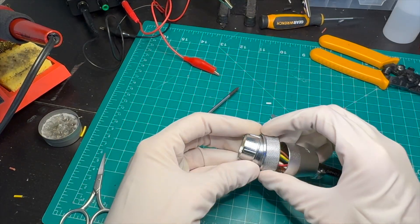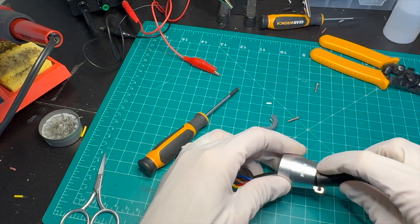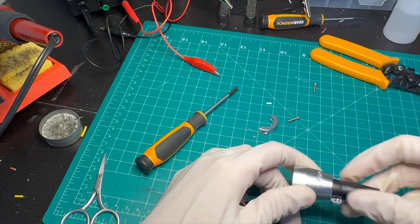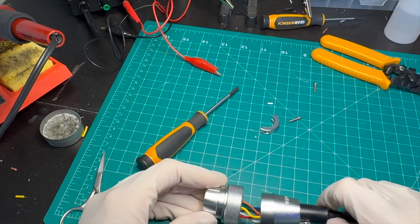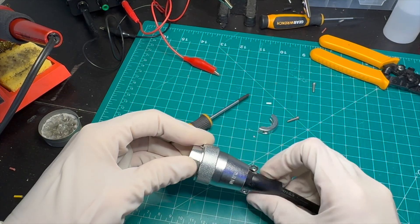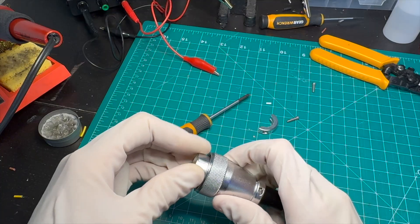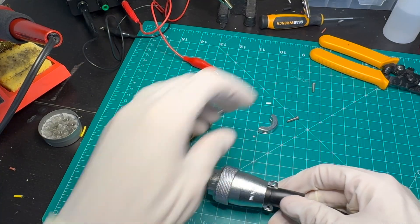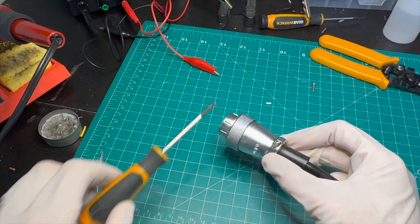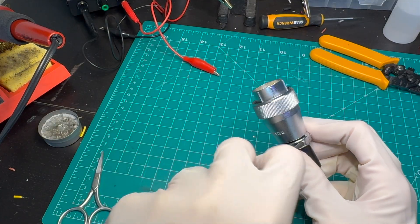Now it's time to reassemble the cable. As you can see, there's a nice metal hood there. It's a little bit redundant to add the shrink tubing onto the individual conductors since this is actually a weatherproof system. What you can see here is essentially a large rubberized adapter that helps to keep water out of that connection. Chicago Crossing isn't necessarily going to be sitting in Chicago weather, but it's just part of the system and it's a nice robust one too. The last step is simply to put the clamp in place that holds everything together. It's a pretty tough-looking cable — do that one more time, and it's a complete cable.